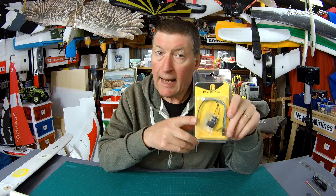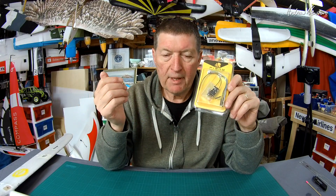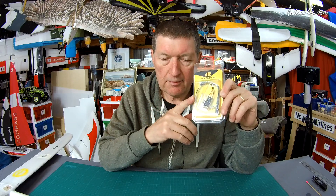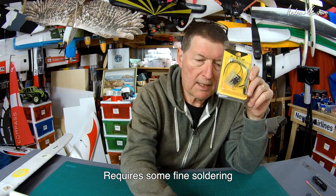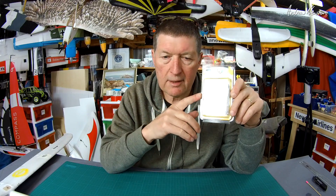You can load the ACCESS firmware onto it, so it will work with ACCESS on the new X-Lite transmitter if you want, or you can leave it as ACCST, which is what I do. It also has smart port, so you can add extra sensors like a current sensor, GPS, and LiPo sensor that will plug directly into the receiver and report back to the transmitter.